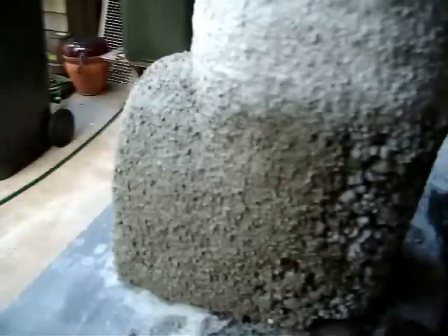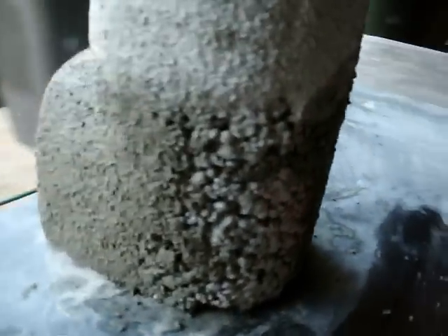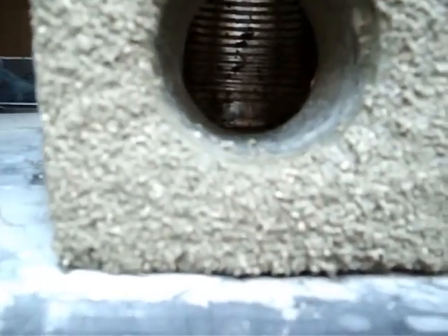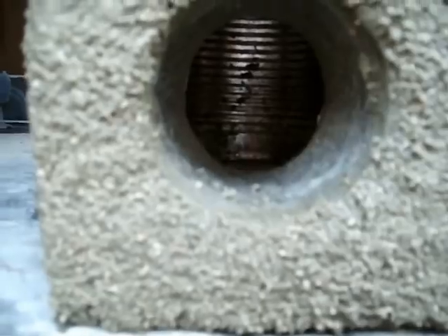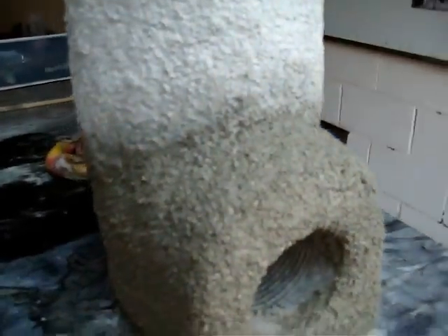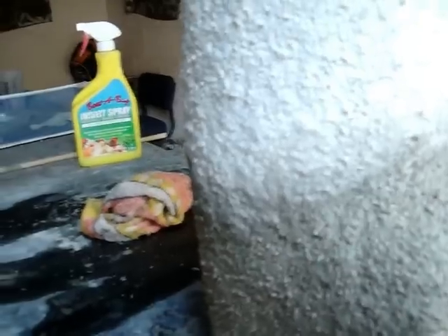Start off with a slow heat and slowly work up, just a bit at the back. This last coat is sieved through a fly screen — I think it's about 2mm at the most, mixed up at 5 to 1. Just three tin cans inside: a three-inch one there, or just over three inch. The stack is two dog food tins, four inch, with little pumice stones on top to hold the pot. This pumice stone should be really good at insulating the fire — very light. This whole thing only weighs about 5kg, that's 10lb.